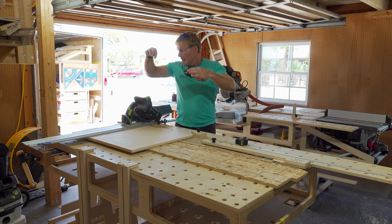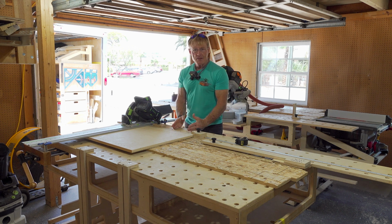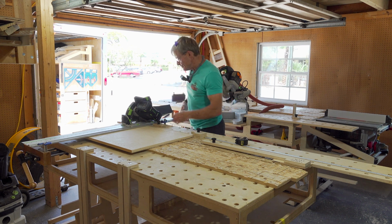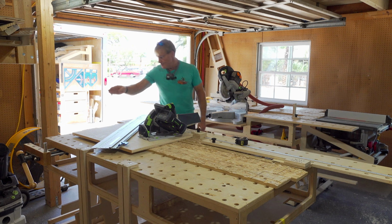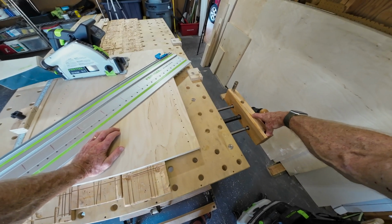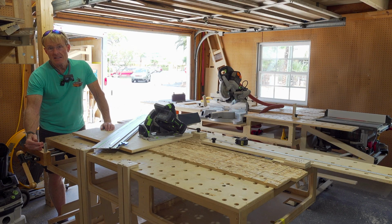There were two of them, I think, and they were 3/4 inch, and they didn't line up with the MFT system. So I plugged them, and I drilled 20mm holes, 4 of them, across the top. And when I did that, I did the layout based on the MFT, so they're 96mm spacing. I didn't have a specific reason to stick with the 96mm.